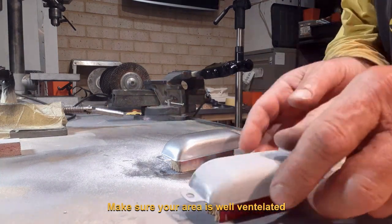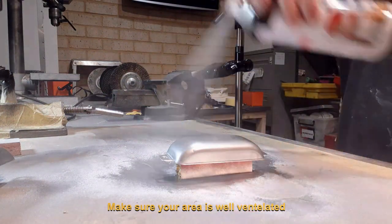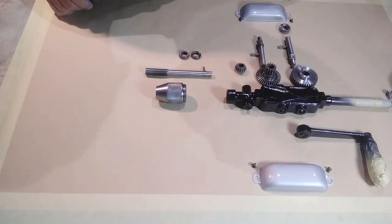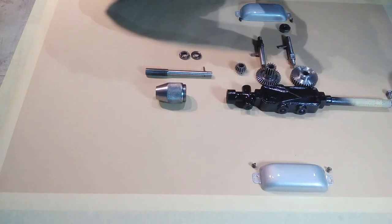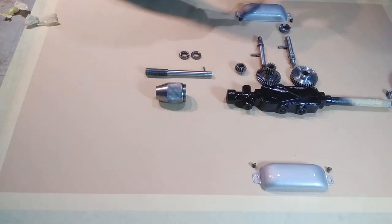I did not colour sand the tool, as the finished colour coats resulted in a nice smooth finish. I did, however, apply a number of clear coats to the painted surfaces just to bring out that little bit of extra shine. Allow the painted parts to fully cure. This time will vary depending on the paint used. For automotive paints, as is the case here, the painted items can safely be handled the following day.